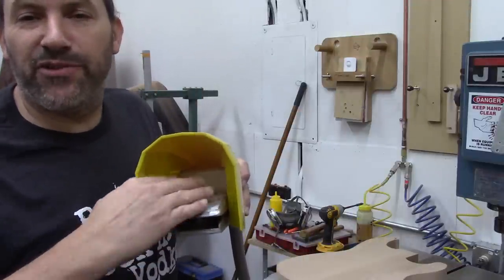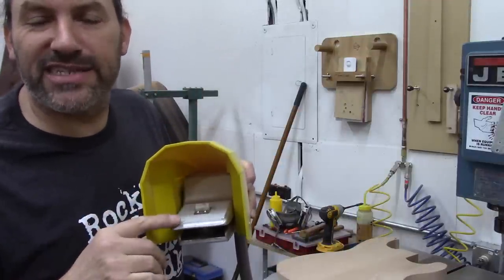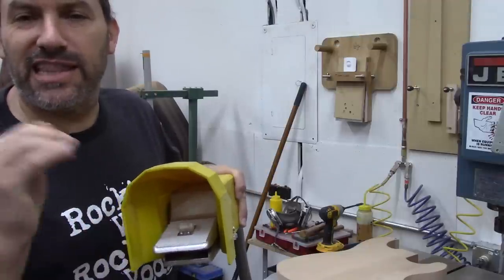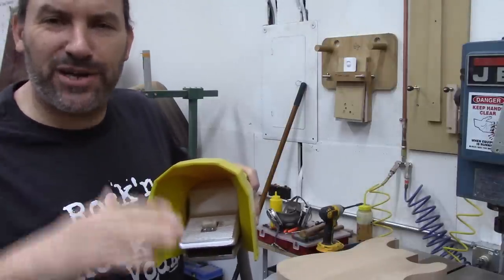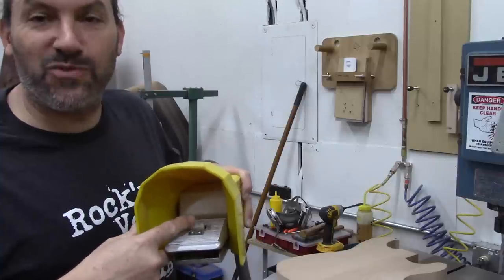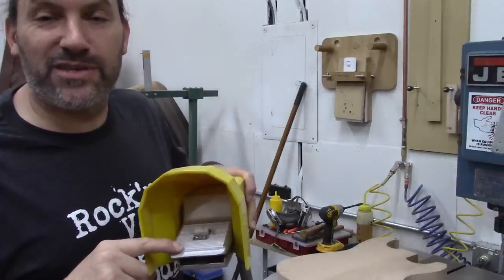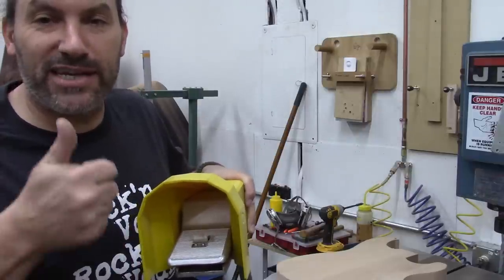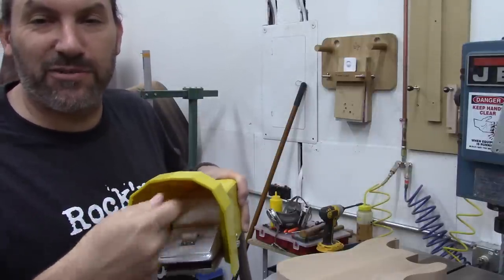As you can imagine, if you put your whole foot in here, you can press down on this switch, but you'll also negate the operation of the latch. So I see a lot of people press in, and the ram doesn't stay down. That's why. Just press on the tip of the switch all the way to the floor and it will stay locked. When it's time to raise the ram up, you need to just kick this little plastic piece out of the way.